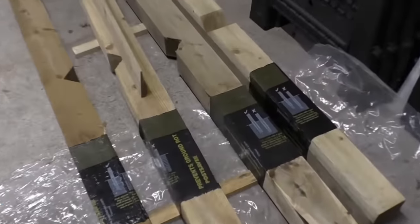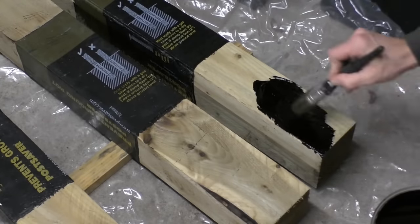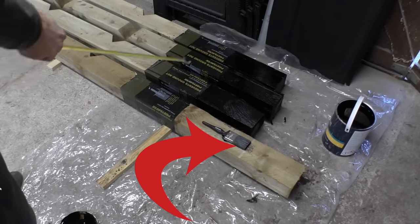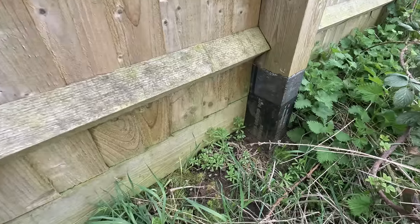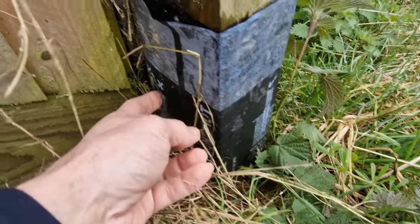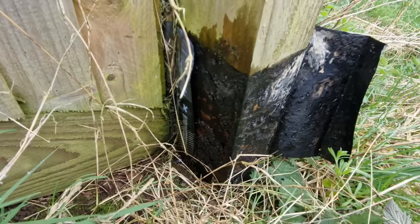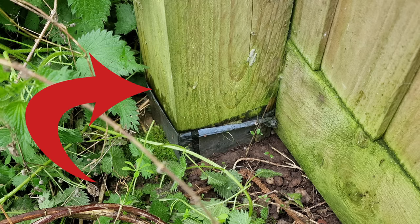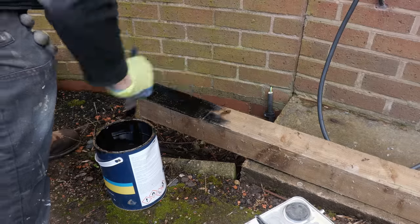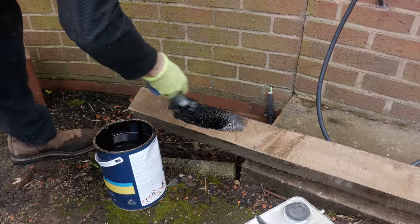You can use post savers as I did with the Aris rail fence four years ago, and I went to the added step of treating the post below ground with Bostik Bituminous paint to prolong the life of the post. But you do have to be careful with post savers — the fencing company who supplied me installed these in the wrong place, and one of them wasn't properly heat sealed to the post, accelerating the rotting process by creating a water trap between the post and the sleeve.